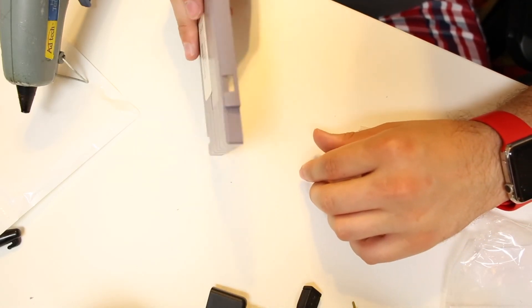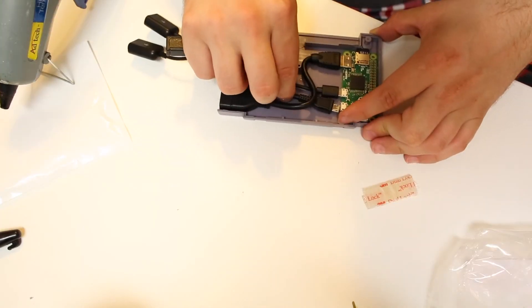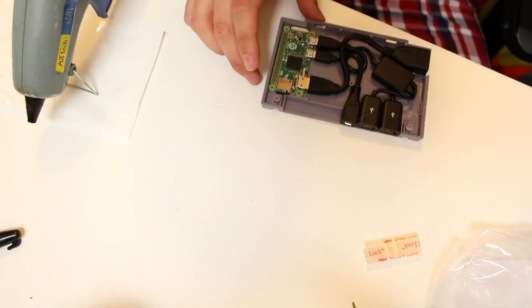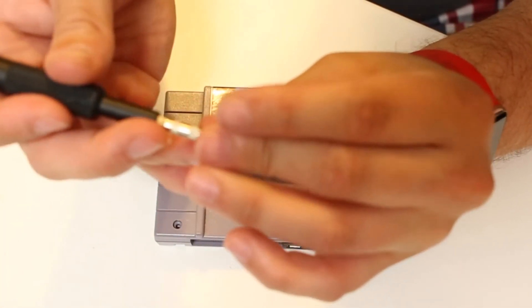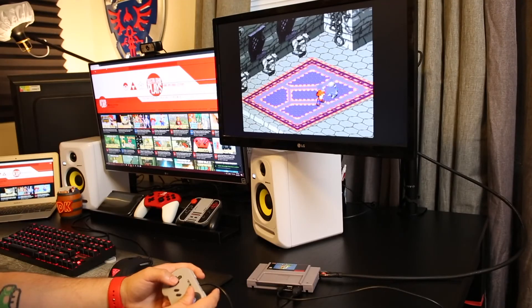With all cuts made, lay the parts in place. Using hot glue (or mounting tape — make sure it's not too tall), secure the Pi, then lay down the HDMI and other wires. When done it's a tight squeeze but it works. Lay the top piece on, make any final trimmings, attach the two screws, and enjoy your new retro gaming glory.